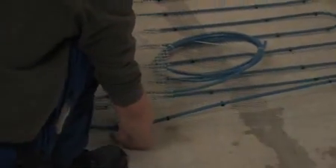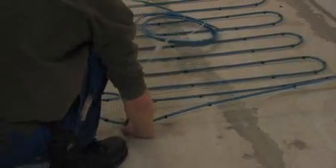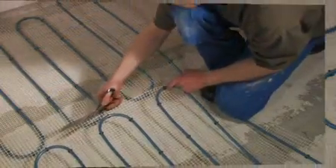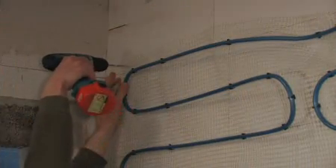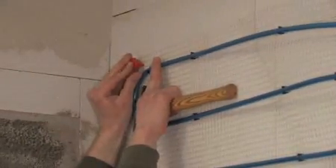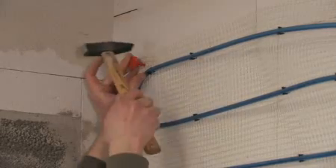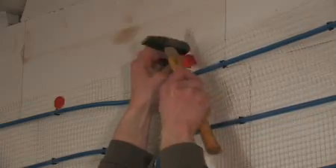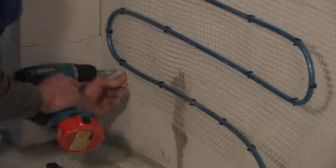The heating mat can now be carefully rotated 180 degrees and laid slightly overlapping, with any excess matting trimmed off. The heating mat halves are held up to the wall and the top fixing points clearly marked so that the lower end of the mat is at least 15cm above the floor and clear of any skirting board.